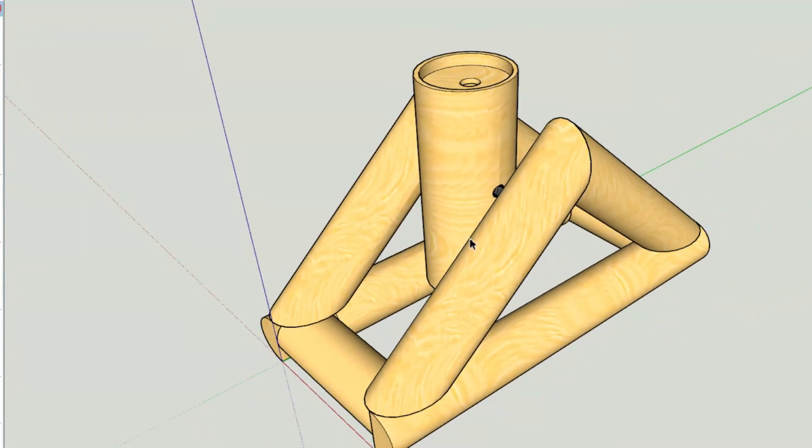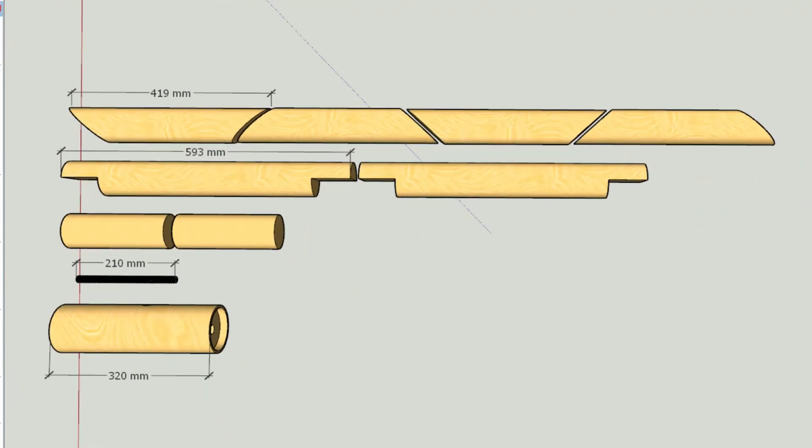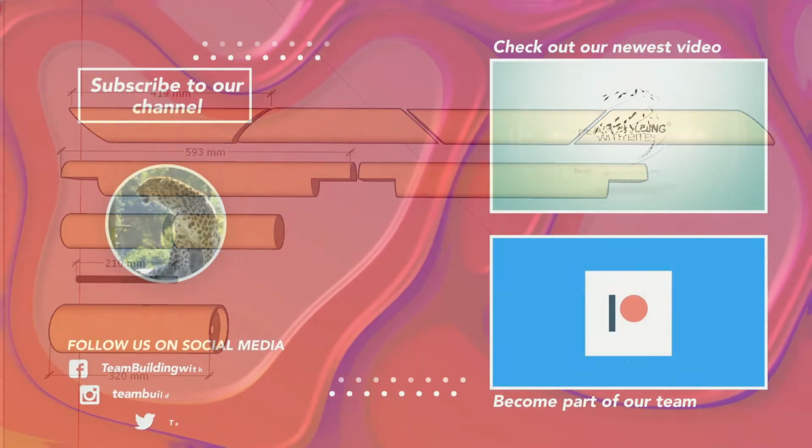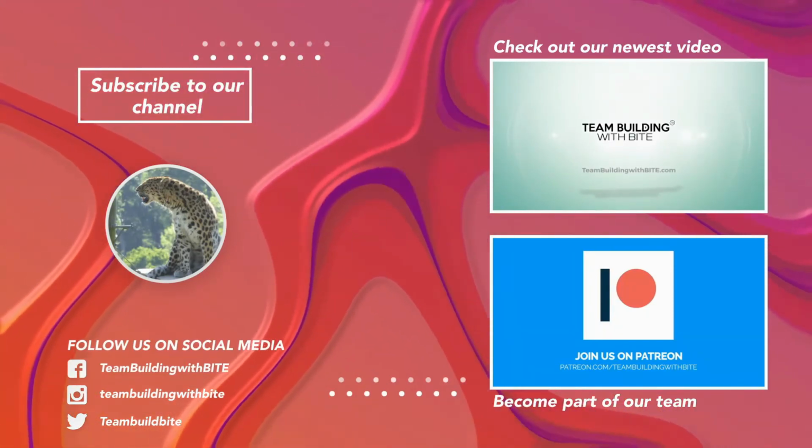Okay, so you've got 4 pieces of timber for the base, 4 pieces for the arms, and then of course the bamboo and the threaded rod just there. So I'll put these on screen again. But if you want to make this wider so you can fit 2 pieces of bamboo on it, that's amazing. What I would recommend though, because of the size of the bamboo and the fact that they're always odd shapes, is to put some washers in between the bamboo. But as I mentioned, it's very, very easy to do. Just make sure you get all of these cuts perfect before you move on.